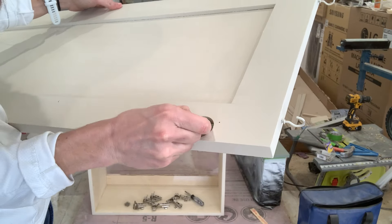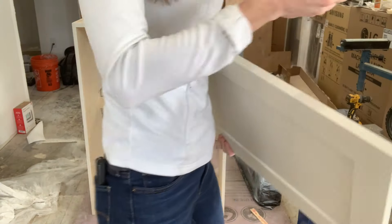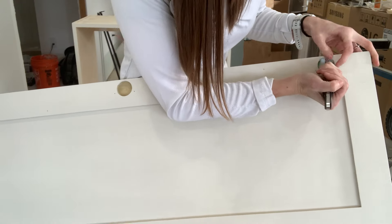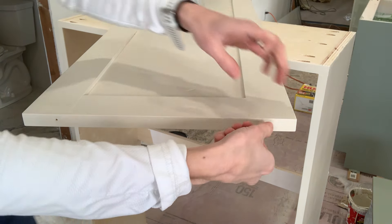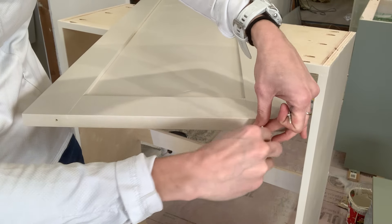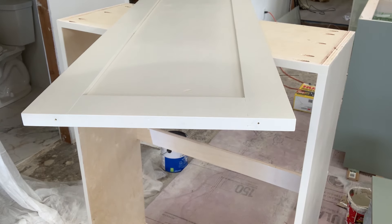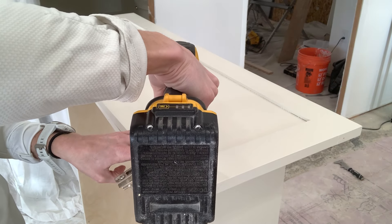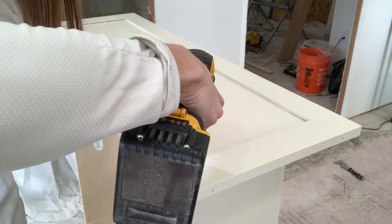Once I was done painting, I removed all my protective tape. I had put tape inside where my concealed hinges went — those little circles — because I didn't want them over-sprayed or too thick for the hinges to fit. I took my little screws out of the top that I had used to hang my doors from the hangers. I put my screw holes for the tall upper cabinet at the top where they wouldn't be visible, and at the bottom underside of my lower base cabinet. But if you were worried about them, you could fill them in lightly and touch them up with a Q-tip or your finger — totally up to your preference.